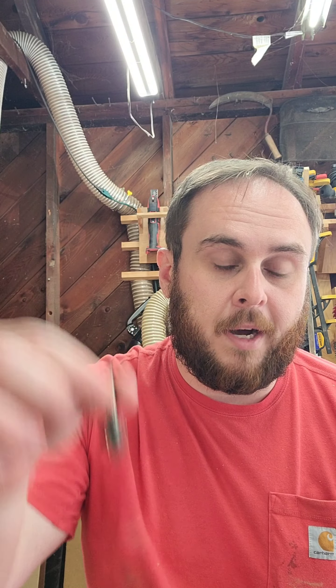Basically, your full depth of cut is equal to half of the width of your V-carve box for your miter. Say you want to cut through material that's three quarters of an inch deep — what you need to do is set up a V-carve where you have a 90 V-bit and the width of your V-carve rectangle is 1.5 inches. That way it's getting half on one side and half on the other, and it'll go through multiple passes but ultimately go all the way to the bottom of that piece.